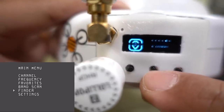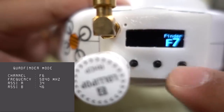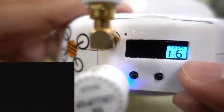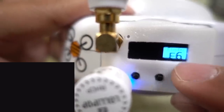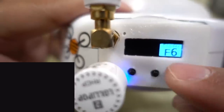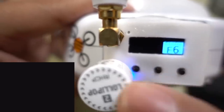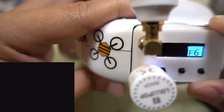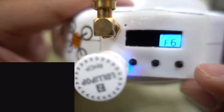And then there's finder mode. I've tuned it over to Fat Shark 6 here — there's some interference transmitting around this band so you have a little bit of signal. You can put a patch antenna on the bottom port and use that to locate your quad if it's lost in trees or bushes. Put a directional or patch antenna on that side, and it'll give you a stronger signal as you rotate towards wherever your quad is transmitting from. This is pretty typical on a lot of goggles right now.